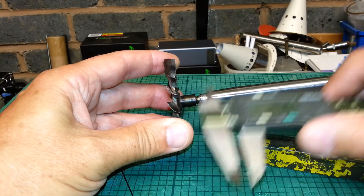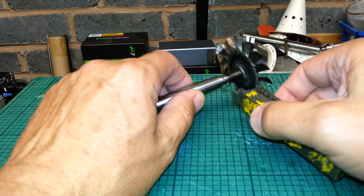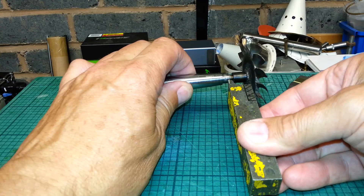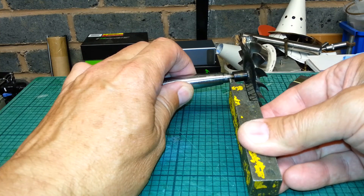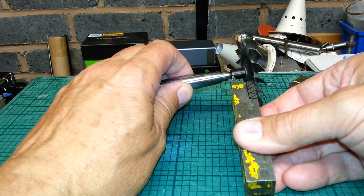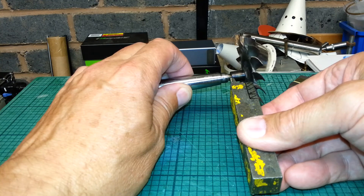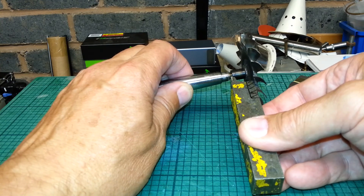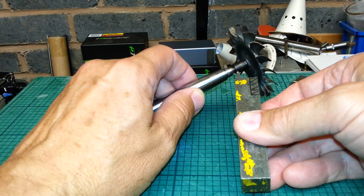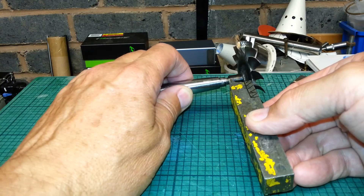What we are trying to do is make this so that this seat is square to the thread. So what I want you to do is take that 5.5 down to 4.8 on the bearing surface, then you need to dress this bit up. Make sure you don't damage the threads — I think you'll just about get away with it, stop before you hit the threads. Clean a good half a millimetre off this face, this spigot on the turbine wheel. Take a good half a millimetre off it to get it nice and square.